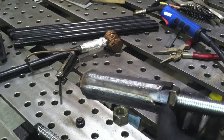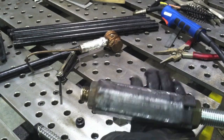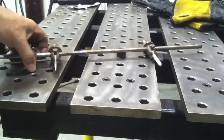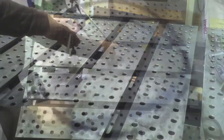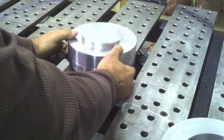I stopped short of welding all the way to the nut, and you can see it still spins freely because that unwelded nut has room to wiggle. I'm using a set of trammel points to scribe a circle, using the little ball lock bolt as a center point. This reminds me of a previous video I did.